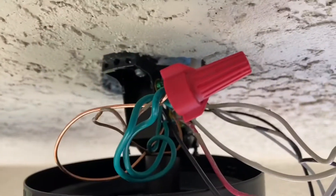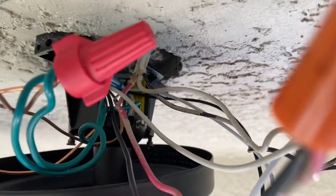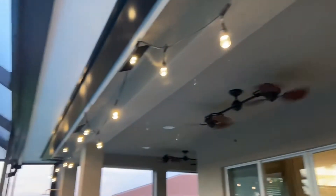Wiring-wise: green or plain copper is your ground. Here is the red wire — that would have lit the light if I chose to do it, so that's on a switch inside. Common is white — white to white, black to black. That's the one for the fan, and that's on another light switch. So wiring it this way, the light switch inside will work the outlet.